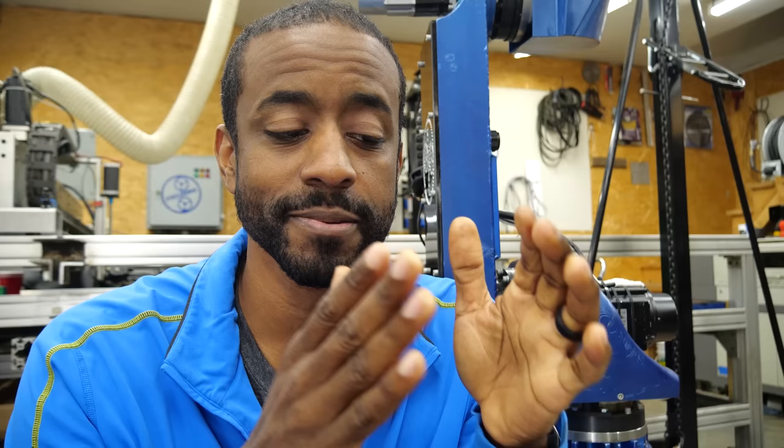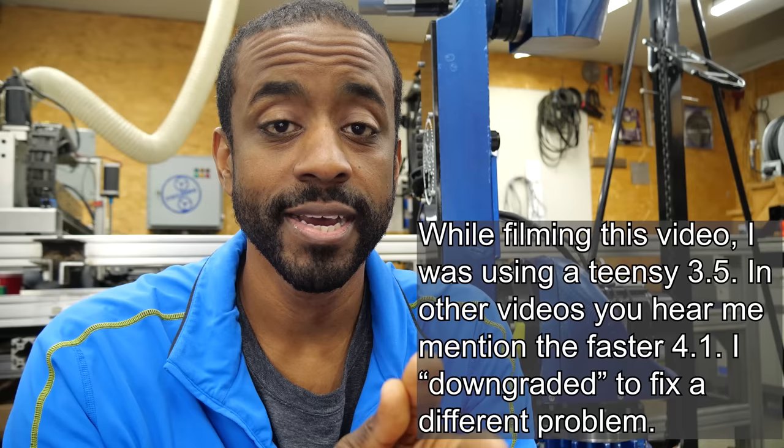We simply can't deliver enough pulses within the time frame available for the robot to reach its position. Add to that the fact that the software is blind and will continue to drift further and further out of position. A friend suggested splitting the task up over multiple microcontrollers — so you might have a Teensy controlling maybe just one or three motors, and another one dedicated to encoders. But I'm not sure that's worth the effort, especially given that I'm already pursuing a more long-term solution of my own making for controlling a robot.